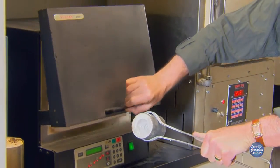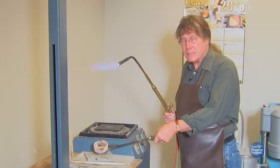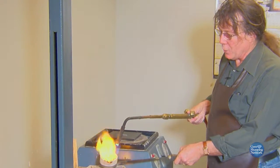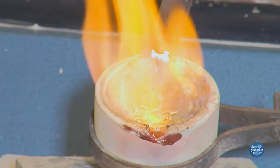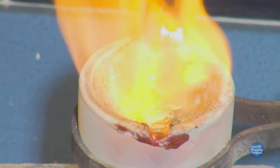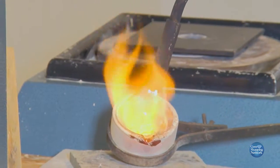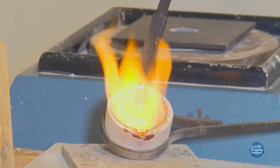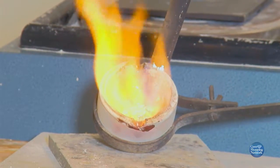You want to get a firm grip, turn it sideways, and we're off. We have our cleaned gold back in the crucible. We're going to melt it together again — we have the flux in there and we apply the heat. We always have to keep in mind that the flame reflection — wherever we point the torch — if we don't do it at the right angle, that flame can be burning something behind you that you often don't even notice. Hence, better to put up your fire bricks to protect against that. Over the many years you kind of learn not to do that, because you've probably burnt something before and learned the lesson.